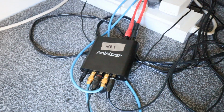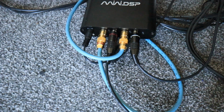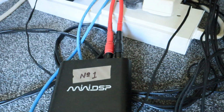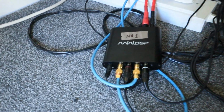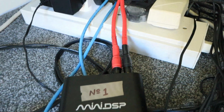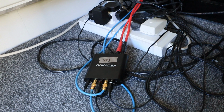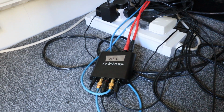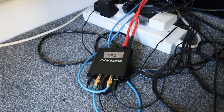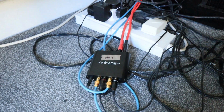Just a further note of caution when you're playing around with any equipment really, you make sure everything's plugged in before you attempt to power up and play. And once it's live, you don't remove any of these signal cables, because if you do, you're bound to do some damage either to the amplifier, the speaker, the drive unit. And over the years I've learnt by experience, I suppose I've written off about 2 drive units over the years just by not remembering to power off before you make any changes to any of the wiring. So just a note of caution.